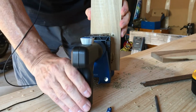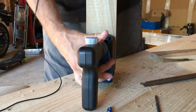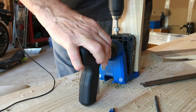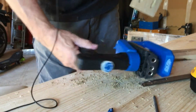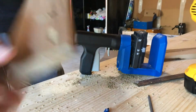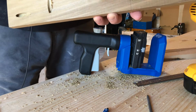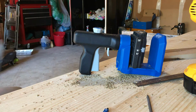And then the last one, there it is. This thing is cool as hell. I like it. And there's your pocket holes, into the legs, into the table on the bottom. Perfect. All right. I will go around and do the rest of those, and I'll bring you back when they're done, and we'll start to screw the legs to the aprons.